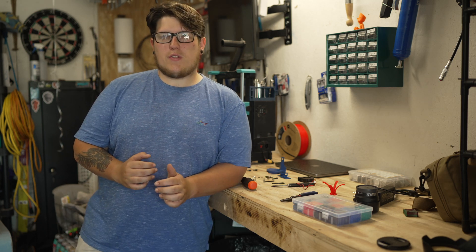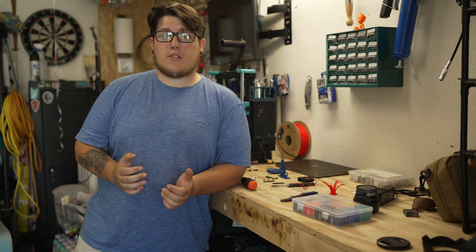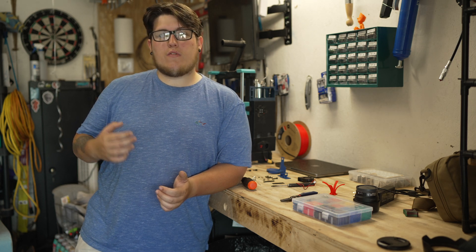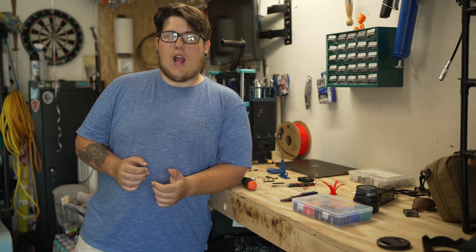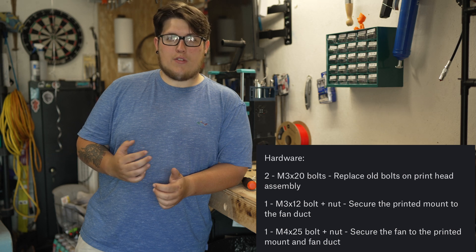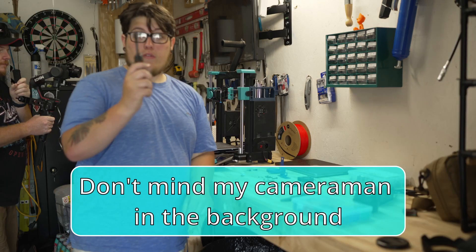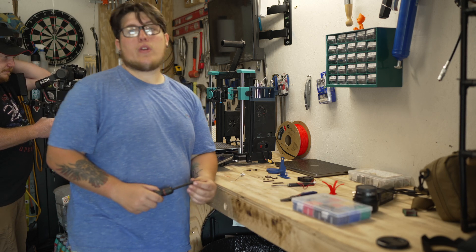What are the reasons you might want to do an upgrade like this to your 3D printer? Basically, it's going to accomplish a couple of things. We're going to be able to print faster, and then we're also going to have better bridges and overhangs, which is going to reduce the amount of support material that you need to use. Let's dive in and take a look at the things you'll need for this upgrade. We'll have the bill of materials on the screen as well as in the description below, and they're also on the Printables link in case we missed something. The first step is we need to pull the old hot end fan off so we can assess what we're working with.